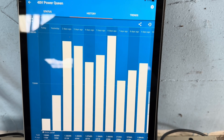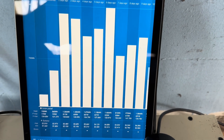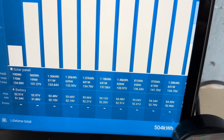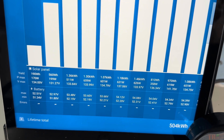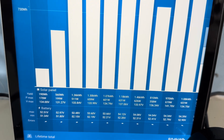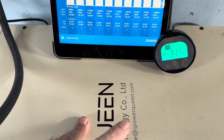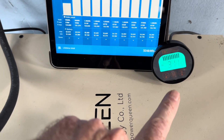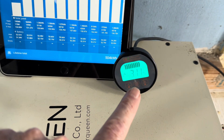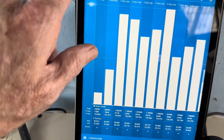We're getting into more favorable conditions as the sun keeps rising, and that 48 volt just runs like a beast. If I look at the Victron app for the past week or so, you can see I was never getting to a completely full charge, but I was getting at least 1.0 to 1.3 kilowatt hours. Yesterday, very dark and rainy, but still picked up 560 watt hours. That was making this battery basically fluctuate between about 60% and 30% full. You can see just in the little time I've had this up this morning it's already back up to 31%.